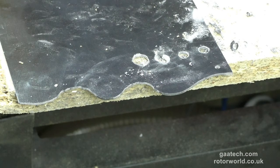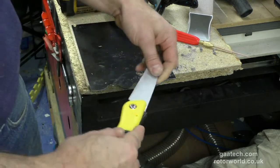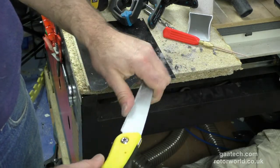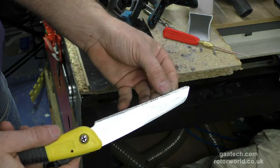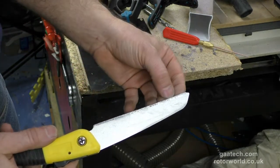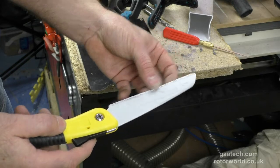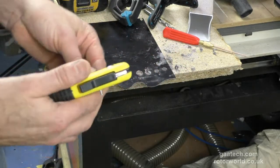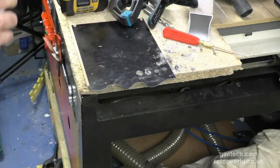So I think it's a thumbs up for the tools we've used today. I really like them all except for this one. I found, although this is a well-made tool, actually it locks out, the grit seemed to be, best way to describe, possibly a little bit coarse and not consistent. So when I was sawing through the FR4, it wouldn't cut smoothly. I was impressed with how easy it is using a hacksaw. Now everyone should have a hacksaw in their workshop.